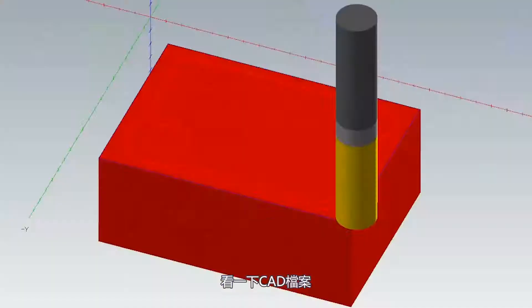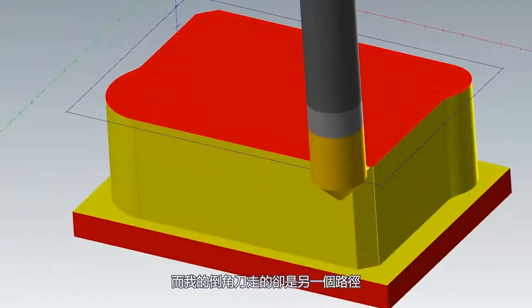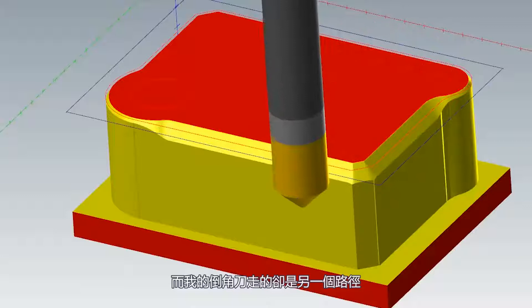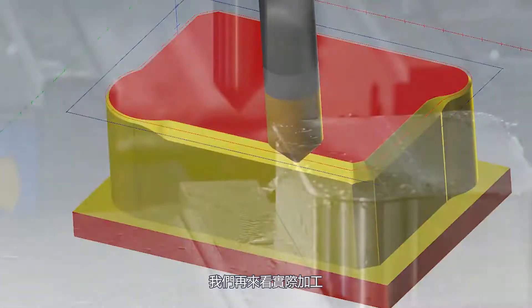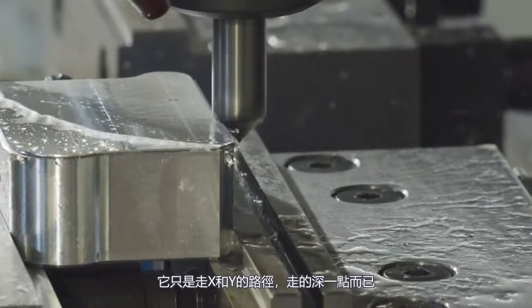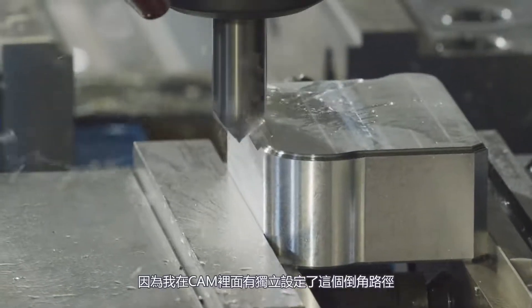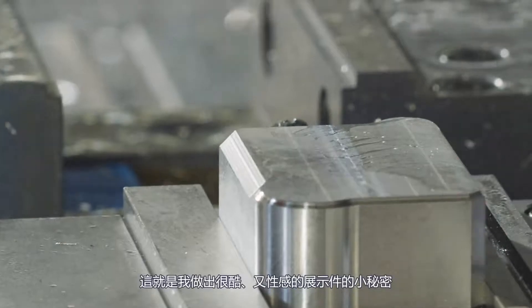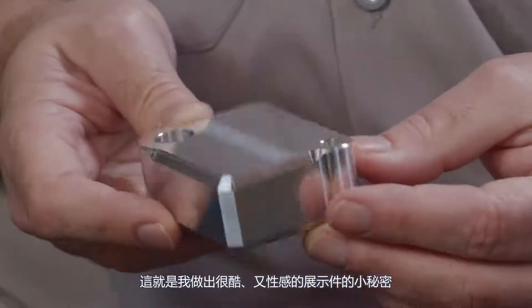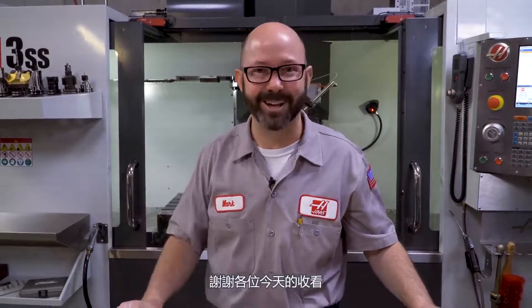Take a look at this CAD file and you can see that my end mill walks around the outside of the part, and then my chamfer tool is walking across a different profile that I've created. If we watch the part run, we can see that our chamfer tool is not moving up or down at all on the Z — it's simply walking around the outside and cuts in the XY a little deeper in some spots than others because I've given it its own profile in the CAM system. This is my secret on how to make cool, sexy looking demo parts. You'll realize it's actually pretty basic and pretty simple. That's all we've got for you today — I hope you picked something up and we'll see you next time. Thanks for watching this Haas Tip of the Day.